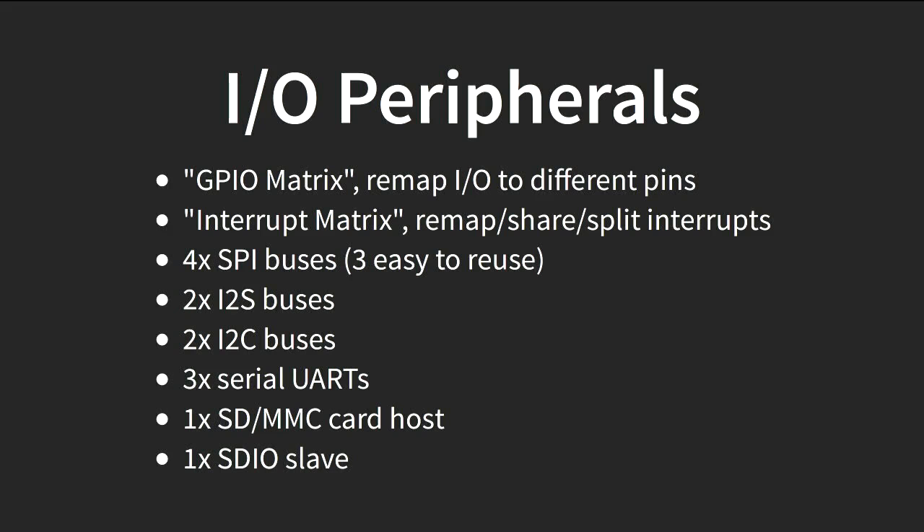There are many ways to connect things to the ESP32: four SPI buses, three of which are fairly easy to use and one that's tricky; two I2S buses — that's an audio data bus that was on the ESP8266 but hard to use, and here it has extra features that allow creative uses, like reading a camera over a parallel interface via I2S. There are also two hardware I2C buses. I2C is a really common way to connect sensors — IOTAS has an I2C bus with four things on it including pressure, temperature, and humidity sensors.